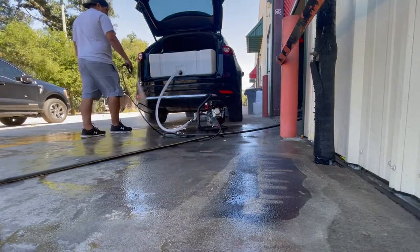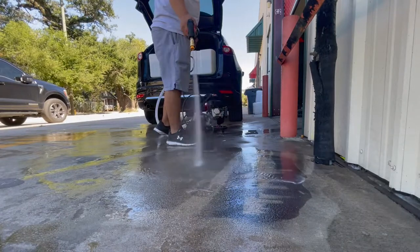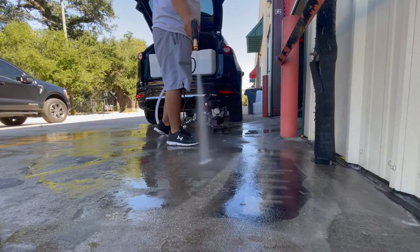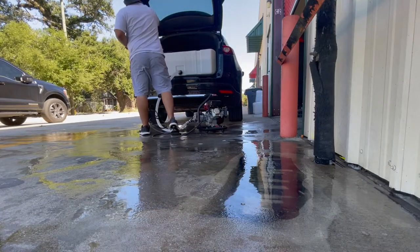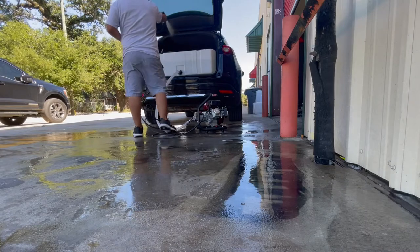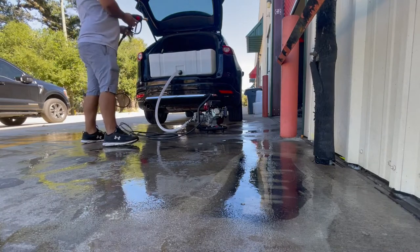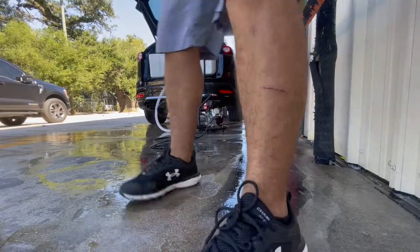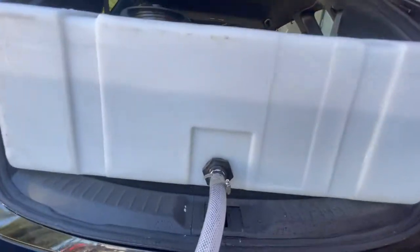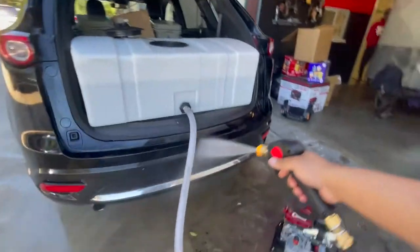The pressure was great — it felt like I was getting the full 1600 PSI at one and a half gallons per minute. I sent Ed to go get a foam cannon and I'm just running around testing and demonstrating the pressure. It's got a yellow tip on there — I think that's a 15 degree tip. You could go to a 40 degree for a wider spread. This unit comes with a soap injector tip, a zero degree nozzle, and this yellow 15 degree nozzle. Also make sure you don't just pick up any nozzle from a hardware store — nozzles are typically rated for your pressure washer's PSI and GPM flow, so make sure you get the correct nozzle flow for your pressure washer.